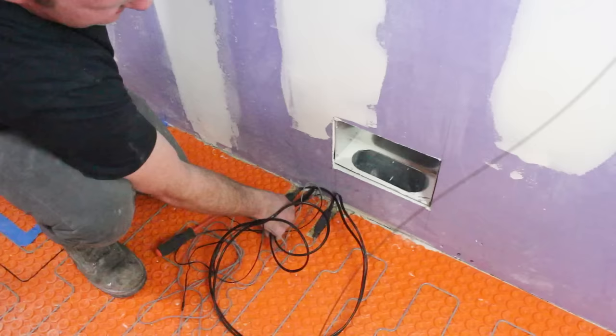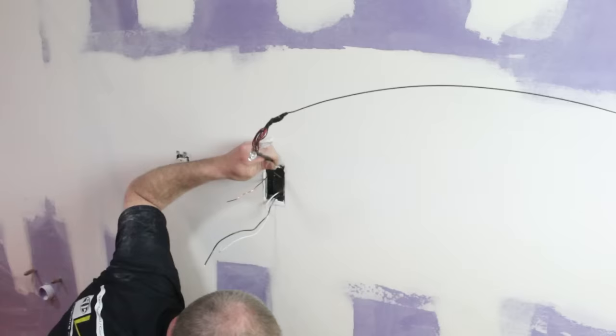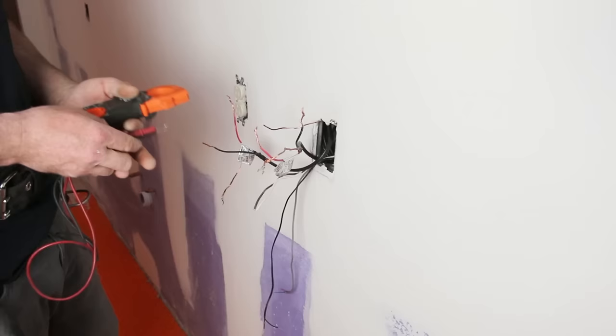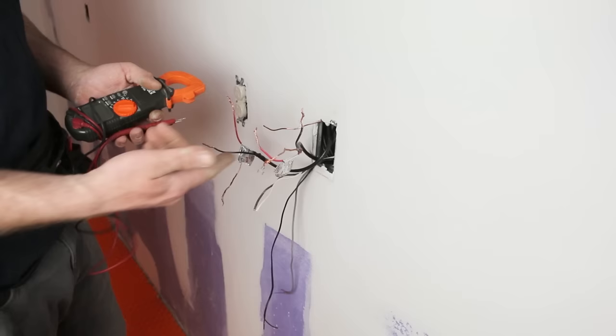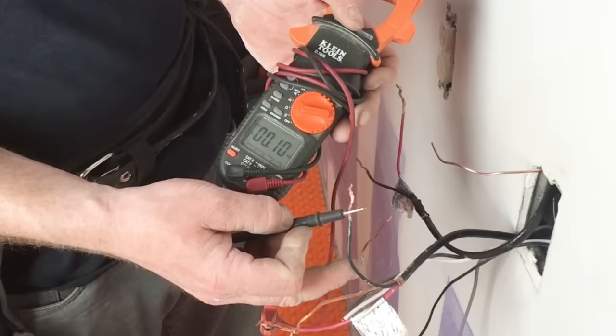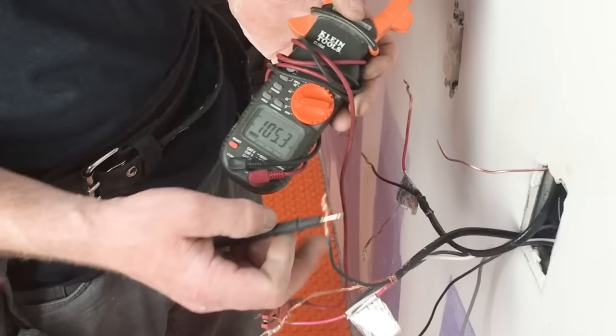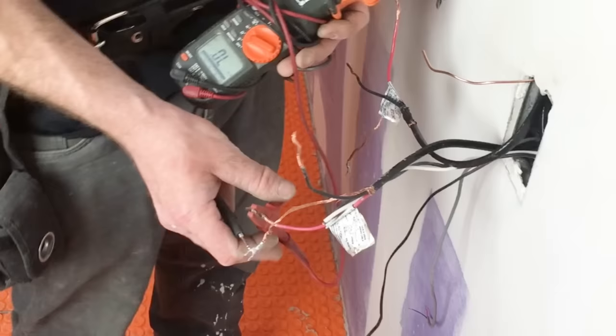All we're doing here is fishing the wires through that conduit and into the box — it's a lot of wire but not that bad to pull through into the electrical box. Now we do the ohm test again. We can see this one's tag says 104 ohms of resistance across both hot leads. Testing it: 104.5 ohms, bouncing around — our paper says 104.2 ohms. That is well within 10%, so we made no mistakes installing.